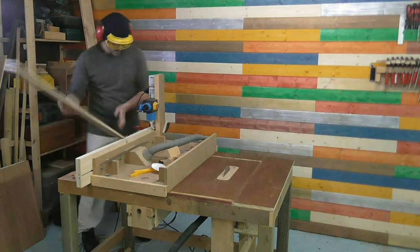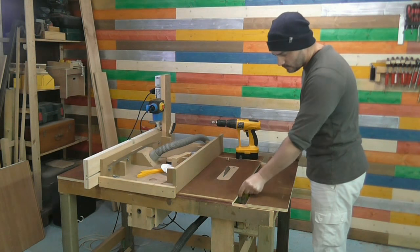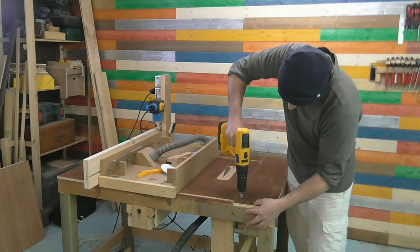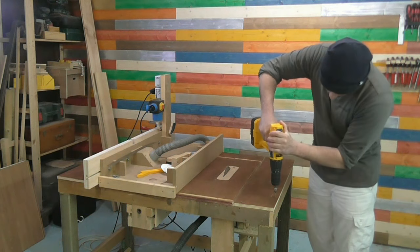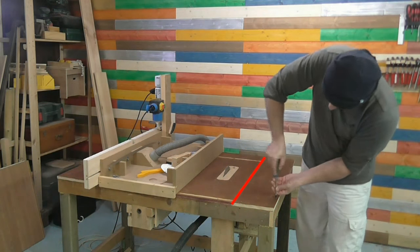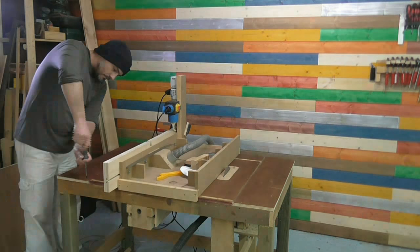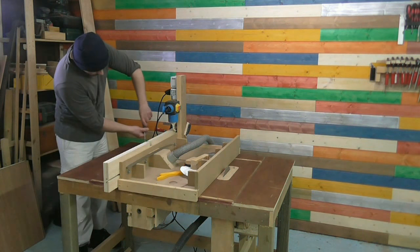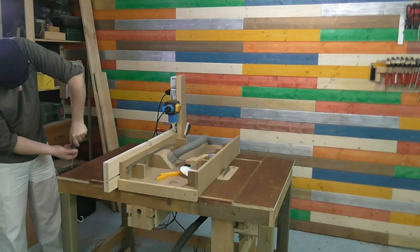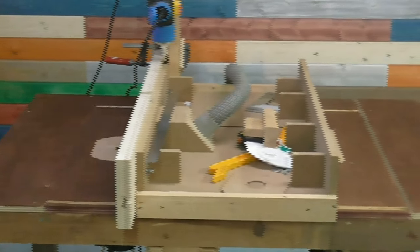One piece goes here, and the other piece goes in the other end of the table. Here I have the screw that I used to stop the table saw sled. And because the table structure is some millimeters longer than the sum of the width of all the boards together, I will leave a groove there, so the screw is not a problem, and the edges of the board fit with the borders of the table structure. The piece I put in the other side fits perfect, and I don't need to leave any groove between the boards. I can unscrew the pieces to put there a full piece of board when I need it.